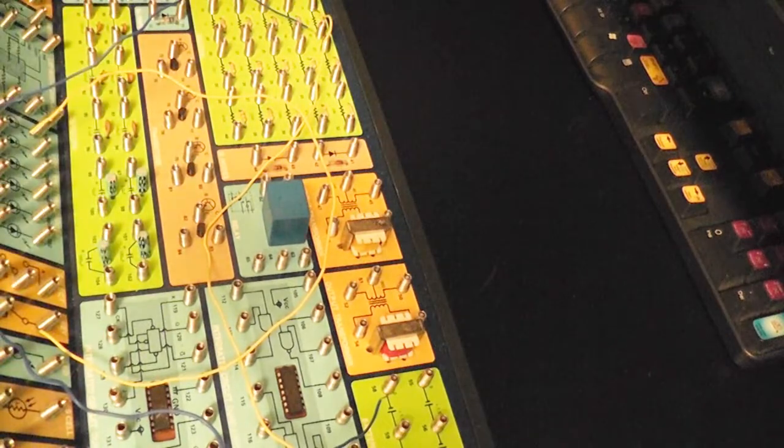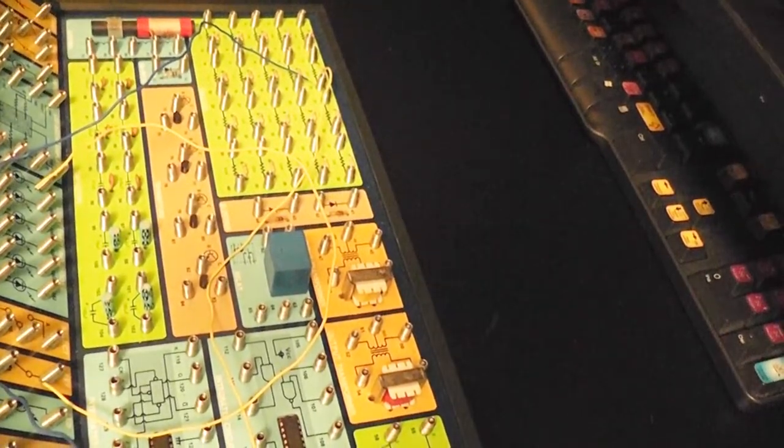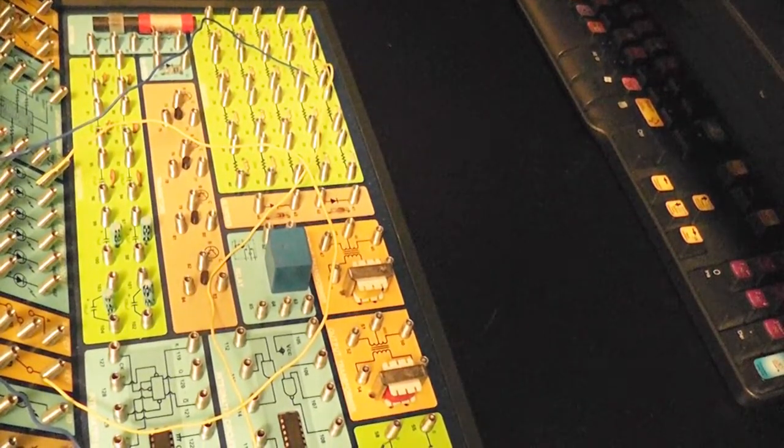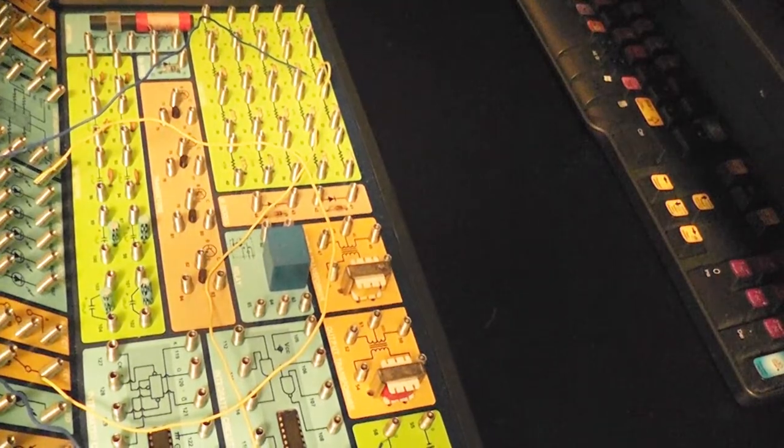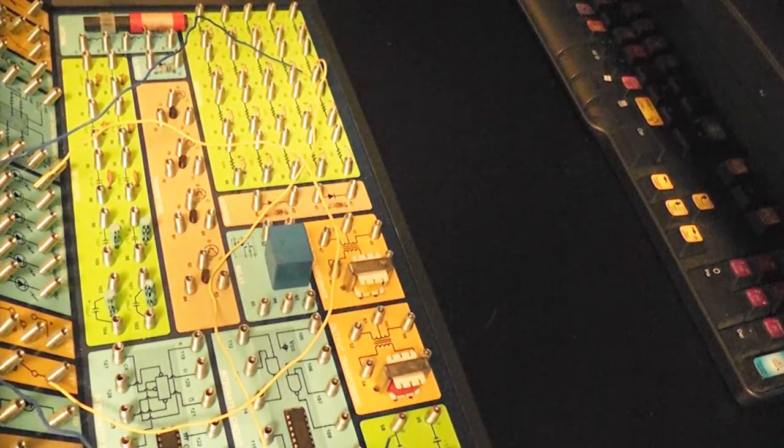There are other projects where you can build a radio, which is why you have your ferrite core over here. There's also a speaker on the front, a volume control and a tuning control. The tuning control would be a variable capacitor and the volume control would be a variable resistor or potentiometer.